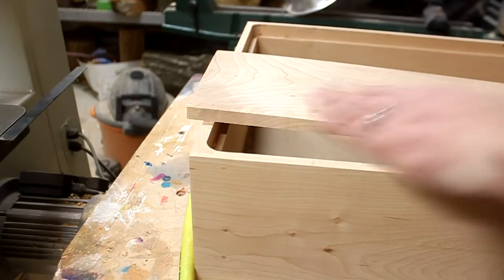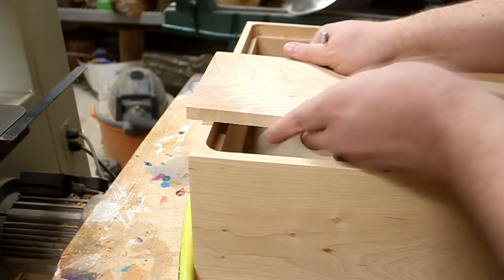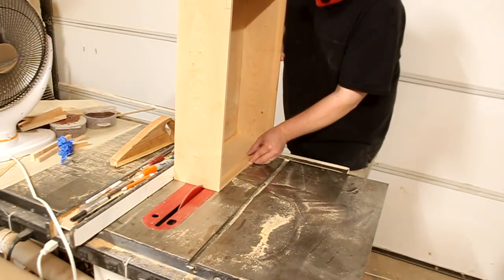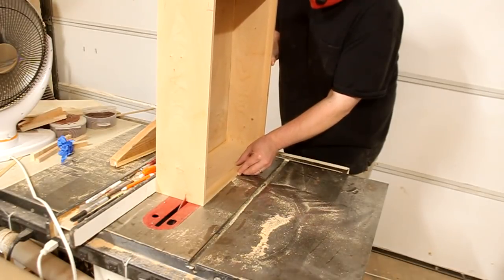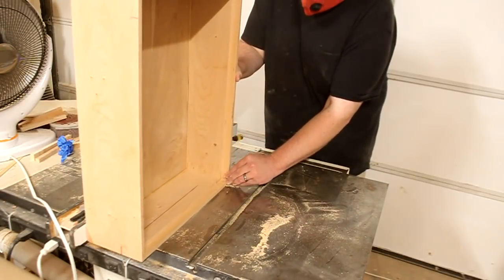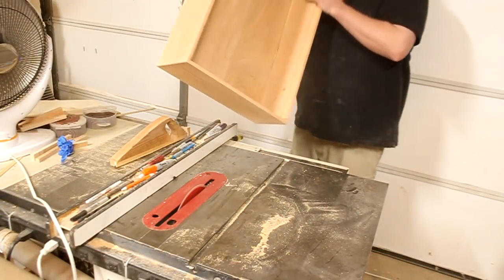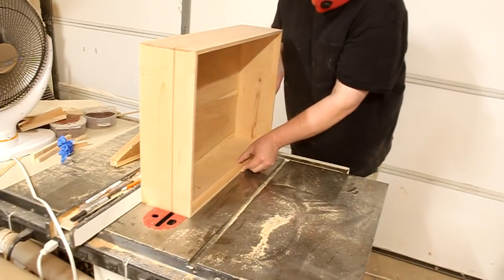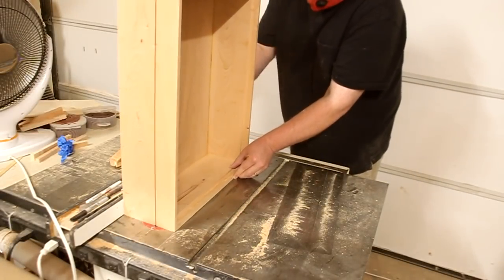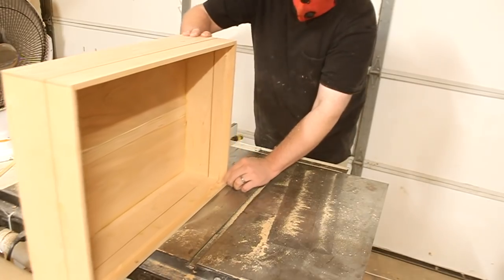Then I measured the board based on that cut - I like to have the relative dimension here rather than trying to get it beforehand. Now that I have the bottom of the board put in, I start to rip the top apart from the bottom of the box. I like to make my boxes this way - I think it gives good grain continuity. Everything looks symmetrical and it looks like it's all from one piece because it really was all from one piece. The only trick is you want to make your final cut on the long side of the box - that way it's not top heavy and it won't tip.